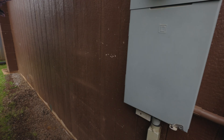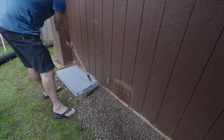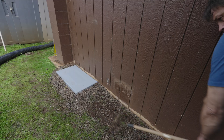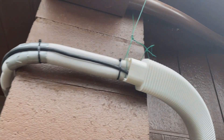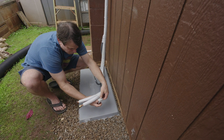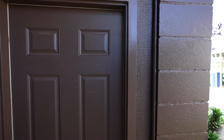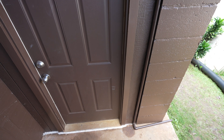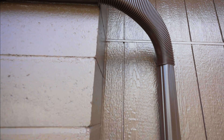Now it's time to go outside and get that outdoor unit set up. Here's my outdoor site location — there's the breaker box straight down the wall and the unit's going to be right there on the end. I'll start by grading the area with some gravel, putting down the mounting pad, and leveling it — grading the gravel around the area so that no water collects around the machine. For my particular installation, the line set comes out of the wall around this block pillar that supports the garage. I use tie wire to temporarily hold it up because it's heavy and I don't want it bending, then run it down to the outdoor unit. I wrap the remainder of the line set with the provided pipe wrapping to keep it clean and reduce exposure to the elements.